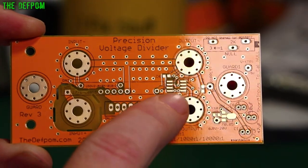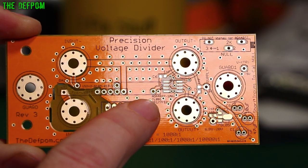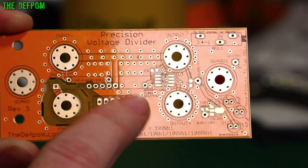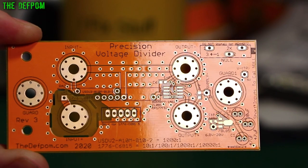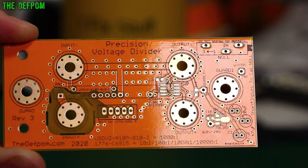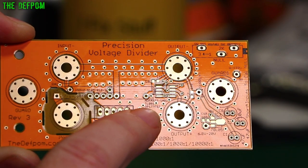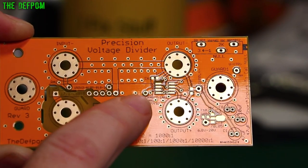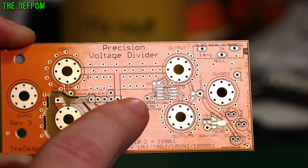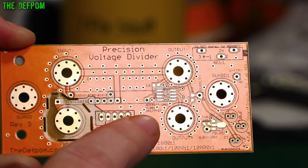I'm going to be building this up. I'm also going to change the op-amp. I can use either the ADA-4077, the TL-081 which is what I was using before, or the OP-177 FSZ. I haven't tried the ADA or the OP yet. In theory the ADA-4077 is the better part - it's the latest revision. It's basically the same series as the OP-177 but a later generation, so it's specced as being slightly better. But there's no offset nulling on the ADA-4077.